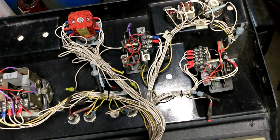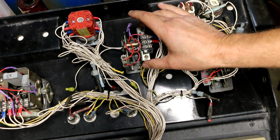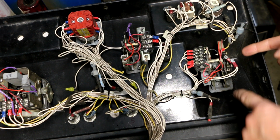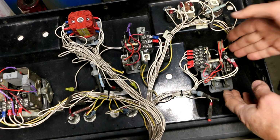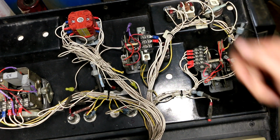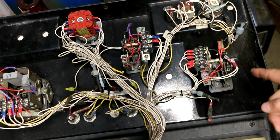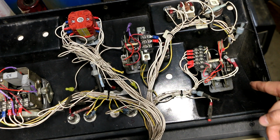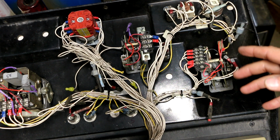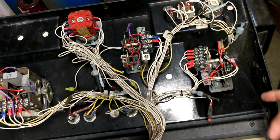All right, I'm almost ready to put this back together. I put this switch in, and now I just undid the 2 screws so I could move this assembly right here, which is the drive assembly to actually drive the unit. Now, I am able to drive the unit, but I did notice that I was having a problem where it seemed like sometimes it would throttle up when I would go to drive and sometimes it wouldn't, and I wasn't quite sure what was going on there.